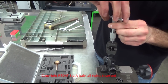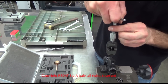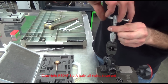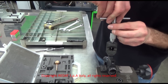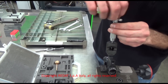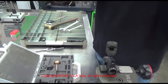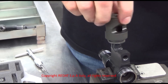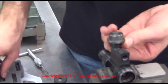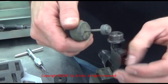It is important to thread as deep as possible. During the operation, it is possible to lubricate the assembly through the openings in the bush. Pay extra attention not to break the tap during this operation. After the operation, blow the area with compressed air to remove any dirt. After the threading is completed, we can remove the bush 4021-641. Take the threaded pin 4021-634.